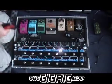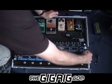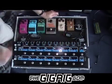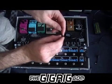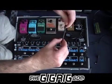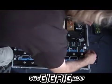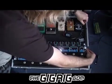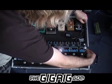Right, so let's plumb the tuner in to start with. We're going to go from the auxiliary output here to the input of the tuner here. If you think that by the time you've cut the lead up, you're going to lose about a centimetre. So I'm going to hold my thumb about a centimetre down the cable, go from that connection there up to where I want the cable to go, and then add another centimetre for the connector.